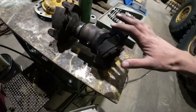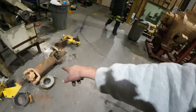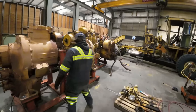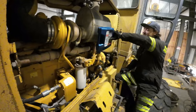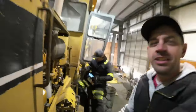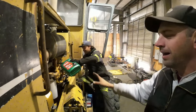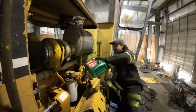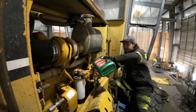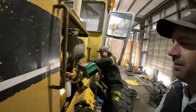That's a whole lot of no oil. We're filling it now — we know this isn't the correct oil spec for this engine, but we're just starting it up to see if it runs, not sending it out to work. Up north these ran on 10-weight or 0W-30 because of cold temperatures, so we're doing the right thing. Slippery is slippery. We do have the proper transmission fluid on hand.